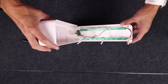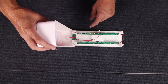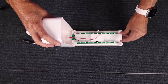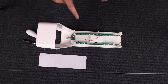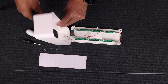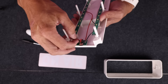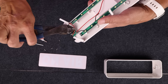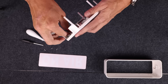We have some wires that go from the LEDs to the board which has the USB-C port on it, some that go to this switch — we don't need that switch anymore — and these go to the battery. This loops the top LED and the bottom LED. Looks like we do not need these wires here, so let's cut these wires. Now we've got the top off and it looks like these two wires here are the ones we need, so we're going to cut these right down by the board.